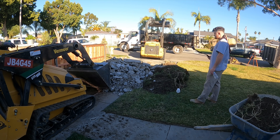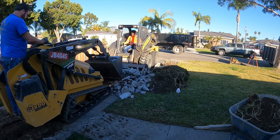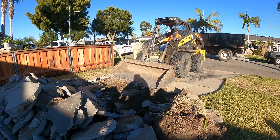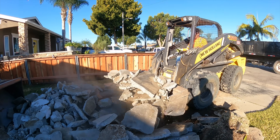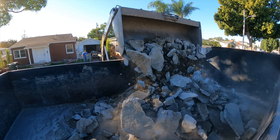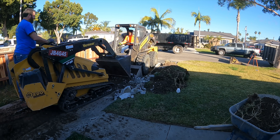This is going to be a raised curb, and it's a double-sided picket fence, so he just took off one side of the pickets. They're going to drop back down on top of the curb. You'll have to cut them all, of course, but they're all going to be the same length because I'm going to put the curb in level — that makes it real easy.